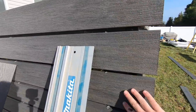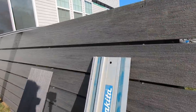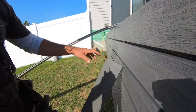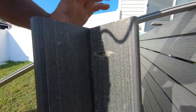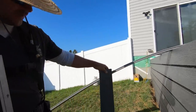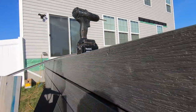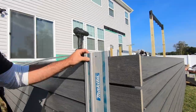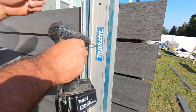First thing we're going to do is cut our corner detail in. You can see how we just run everything along — we've got a mark here, we're going to cut this with the track saw. So we made these corners, we pre-make these real nice and professional. No screws visible from the outside — all finished. Now we've got to transfer the measurements to my cut. I have my two marks, and the tricky part is attaching this to the wall. Pre-drilled holes where the track doesn't come into play.